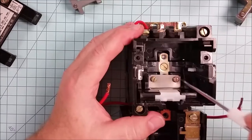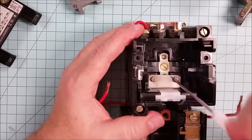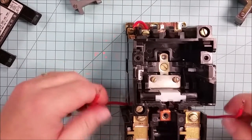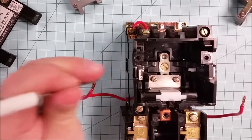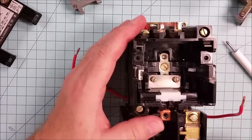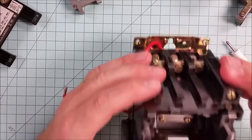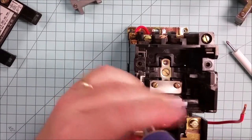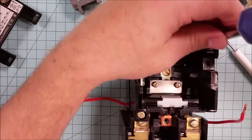This also tells you that you can bump test. Sometimes for rotation with three-phase motors, if you reverse two of the three leads, you get the opposite rotation. And so what we'll do quite often before we actually fire the thing up, we'll take a screwdriver and just depress this briefly to see which way the motor is going to be rotating. And that way we know it's correct, rather than turning it on to full speed and finding out that it's spinning the wrong way. If that happens to be a pump, it might spin off the impeller, and nobody is happy when that happens. So phase rotation is something that's very important with three-phase motors and machines.